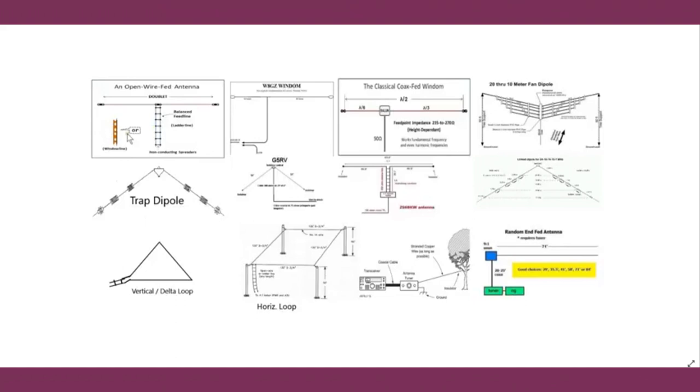What's important is that you have a tuner at the end that can match the antenna to your transceiver. The impedance at the center of the antenna is going to vary all over the map, anywhere from 5 to 5,000 ohms. That's why we have to use super low-loss feed line. Window line is fine except when it gets wet it tends to be considerably lossy, so I prefer ladder line. The antenna is supposed to be balanced — ideally level — but they almost never are.